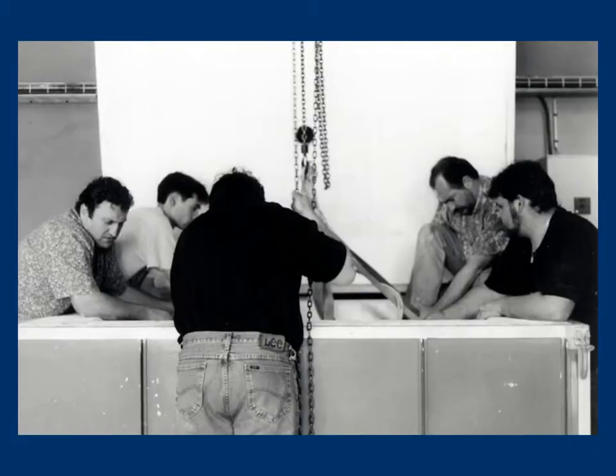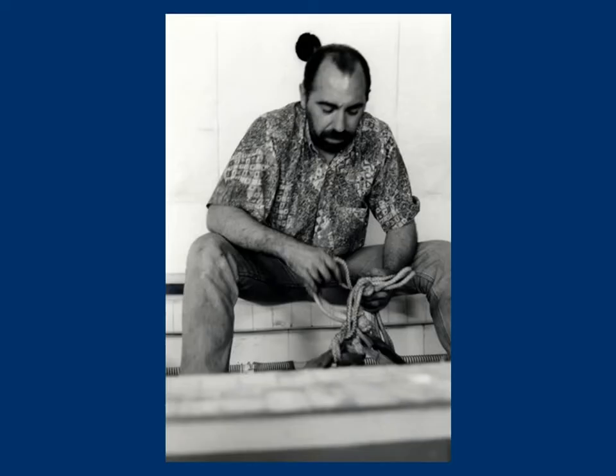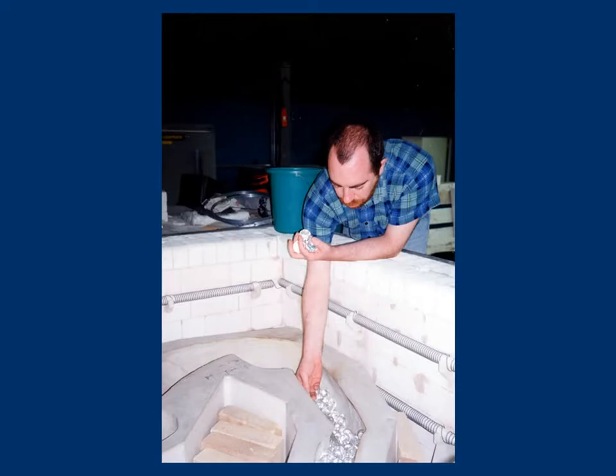Putting the piece in the kiln was a long and strenuous operation. A whole day was dedicated to it because the dimensions of the kiln were not conformed to the information given before. To compensate the thermal gradient due to the kiln and the shape of the sculpture, some heavy bricks are laid in different spots. This operation allowed us to gain a certain homogeneity through inertia. Once the mold was positioned, it was filled with crystal balls — density 3.6, made up of 30% lead.